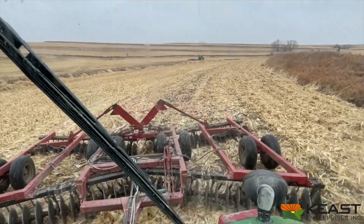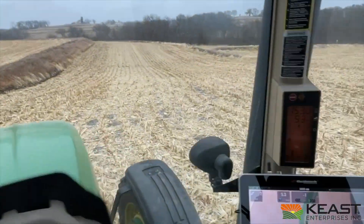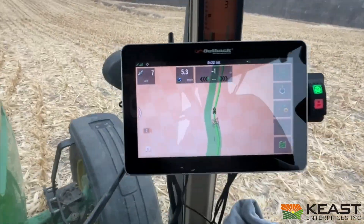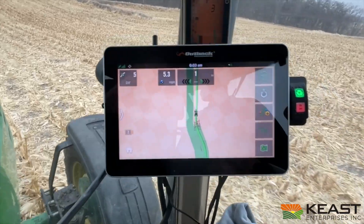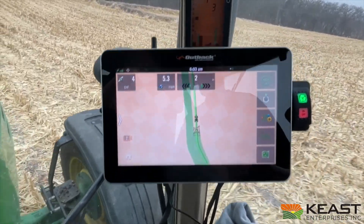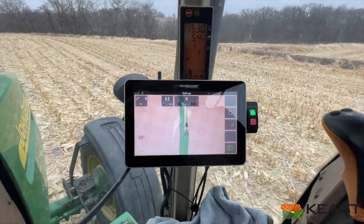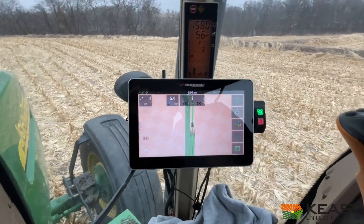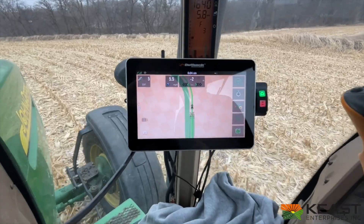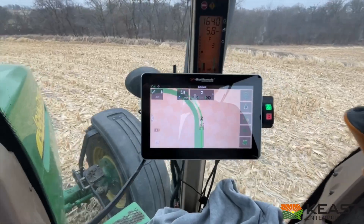The A631 running right now for GPS correction is currently on WAAS or SBAS — that's really the lowest correction available, running sub-one-meter accuracy. And I'd say we're seeing a lot better than one meter — maybe an inch or two off. If you're planting corn rather than doing tillage, I'd recommend the row crop correction, which runs 1 to 3 inches pass-to-pass accuracy. That's a subscription on the A631 antenna.